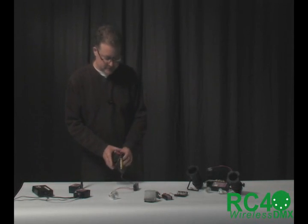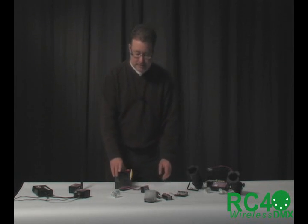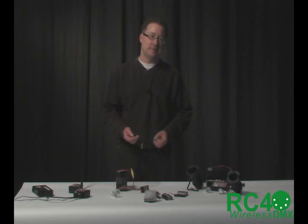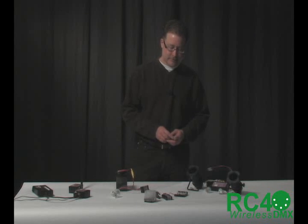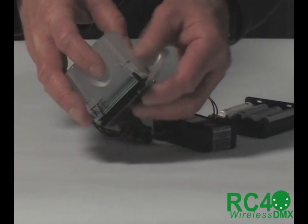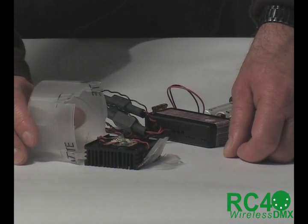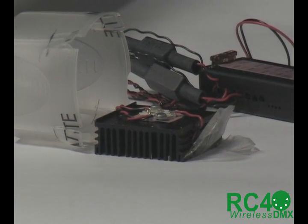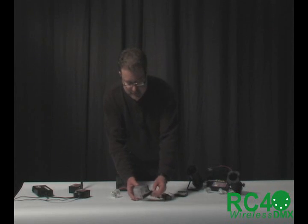Sometimes you want to have more than two channels. There are many applications where you just want to put up a light and a table lamp or something like that, but sometimes you want to get into some color also. You might want to have a light source that's quite close to your talent, near an actor, maybe near something where you're worried about heat or flammability — and that's where you want to think about LEDs. LEDs are great because you can do colors also. We have here a red-green-blue LED component — the same device that you'll find inside many of the LED fixtures that you're familiar with.